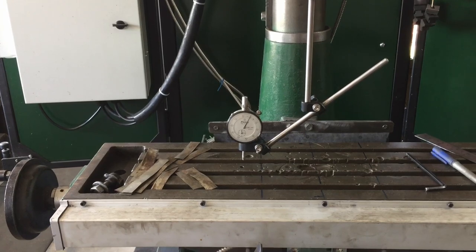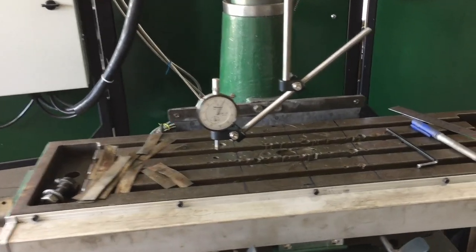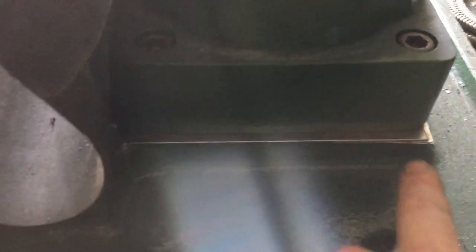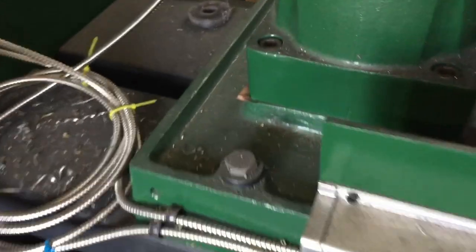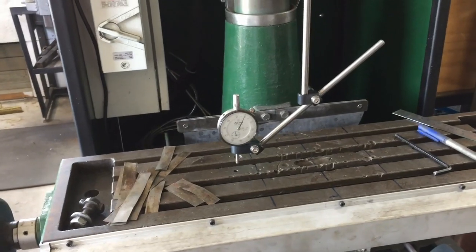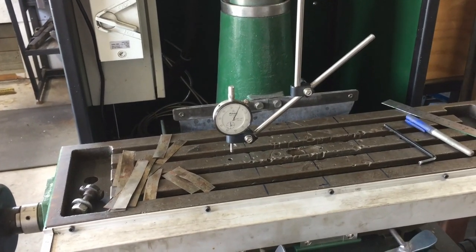I'll quickly show you what I did - doing this freehand so I don't have to drag the tripod around. You can see I've got the 1.2 millimeter shim in place and I've put the other shims underneath - these are all around two thou shims, so I used three or four of them. On the other side I've just put them in the back there like that. I'll run some cuts and come back and let you know how it went.